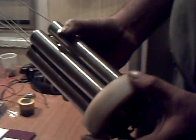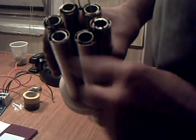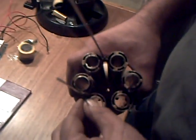What we did is we sanded down the edges of the fly cutter so the pipe would press fit in — we took a couple thousandths off. And then on the inside you can see we took these little rubber tabs and stuck three of those in there to kind of help space it out.